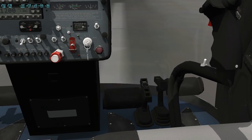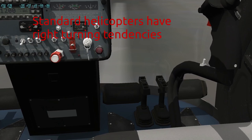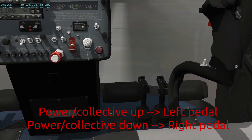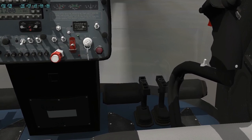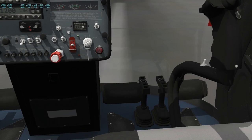These affect the pitch of that tail rotor in the back. A traditional American helicopter has a main rotor system that rotates counterclockwise as viewed from above. As a result, helicopters have right turning tendencies, whereas airplanes tend to have left turning tendencies. So as you increase power you have to put in left pedal, and as you decrease power you have to put in right pedal. As you're flying a helicopter, you'll learn that power up or collective up means left pedal, and power down or collective down means right pedal in order to keep the thing going straight through the air.